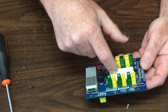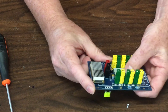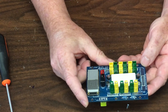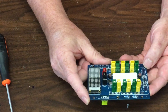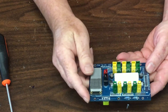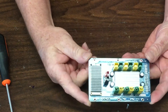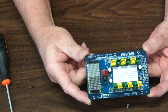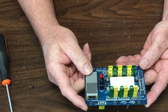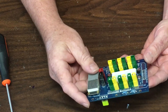Underneath the small heatsink are six motor controller chips, each capable of supplying 15 amps, though the design assumes 5-amp continuous current — equivalent to a bilge pump motor under fairly heavy load. If you exceed capacity, they'll get warm and shut down. There's a lot of protection on these chips: under and over voltage protection, short circuit protection, and thermal protection. They have a very low internal resistance of about 70 milliohms, so heat dissipation is minimal.